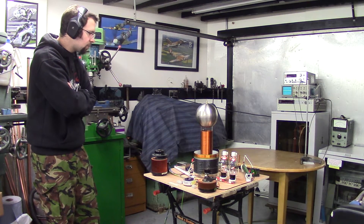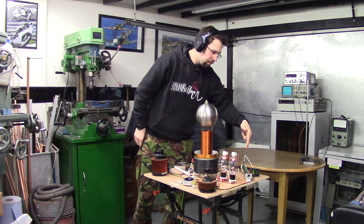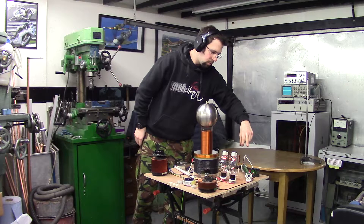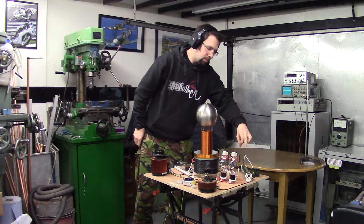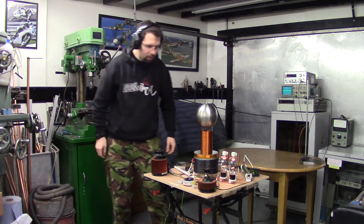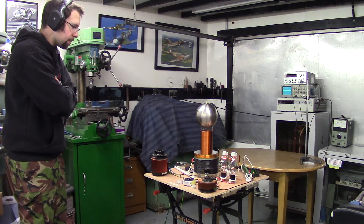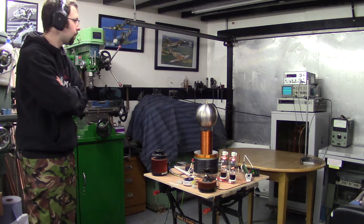And other changes — I've also moved the grid coil here. I've put that on the 45mm, stuck them over the back also with the capacitor. I've still yet to make that bit adjustable, so maybe soon I'll be doing that. And that's just about it really, just rearranged it a bit, but it's in tune now, so you'll see that this will be running quite a nice output now.